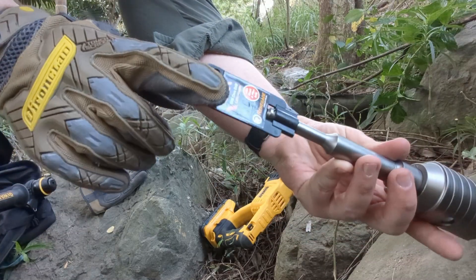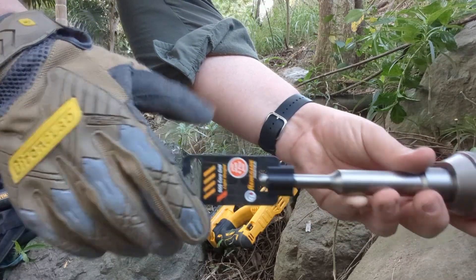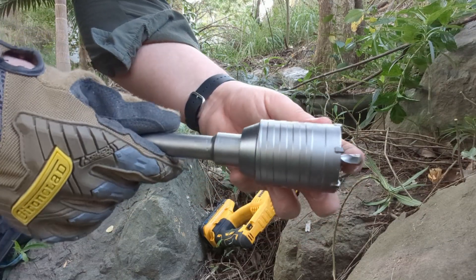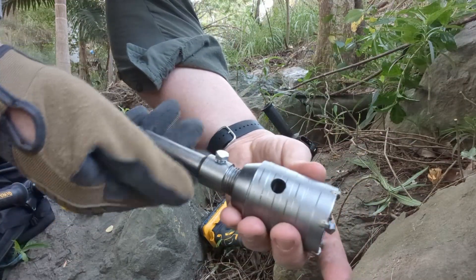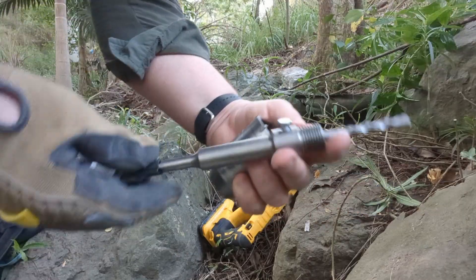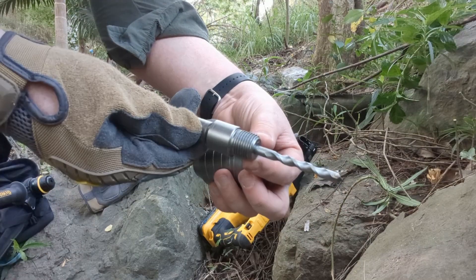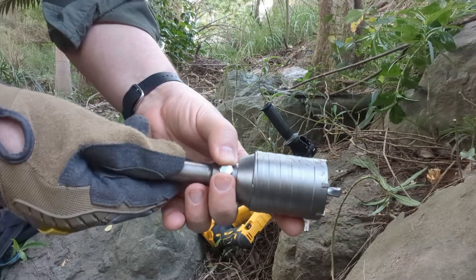So this particular one is just a sort of home brand one from one of our local tool chains here in Australia. It's 50 millimeters, or about two inches. It looks like it's got an eight millimeter guide bit inside there. It seems to work just like a normal wood hole saw — you've got your guide bit there, that sits inside an Arbor SDS for our rotary hammer. That's like an M20 thread, and the guide bit is held on with a screw into the Arbor.